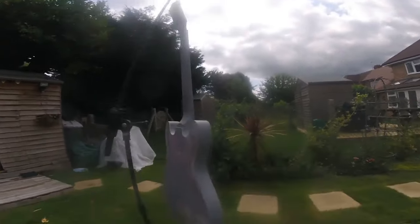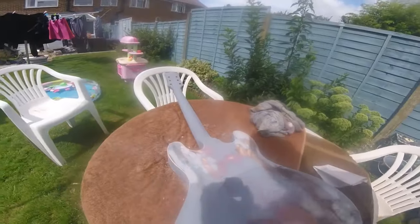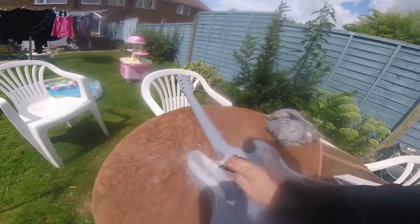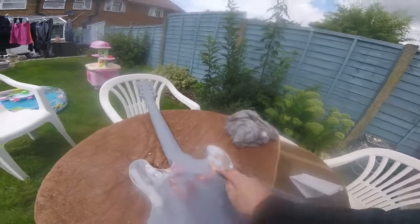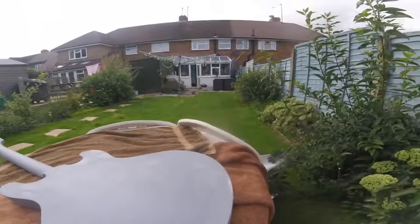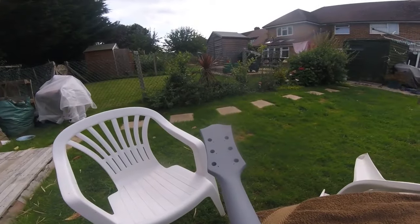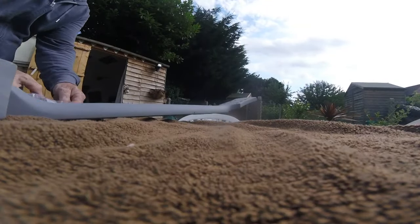You can see I did have a go with the stain on the back of the guitar just to see what it would look like — it just looked terrible. So I filled in the bad bits and I'm priming and sanding, priming and sanding, to get as smooth a finish as I can and get rid of all those nasty spots. Going up the grits — starting with 120, 180, 240, 300, 400, 600, 1000 and all of that.